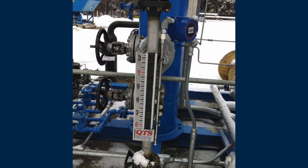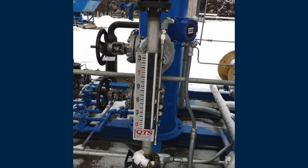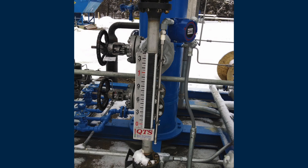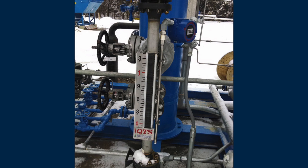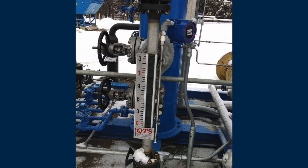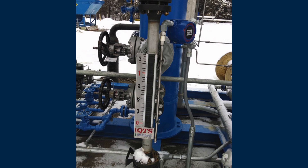They connected the ground wire at the power supply, and then touched the ground wire of the instrument to the housing — and you watched the instrument work. They removed it from the housing and you watched the instrument go haywire. This happened within a second. In this case, the issue was the wiring. I went back with my loop calibrator all the way to where the power supply was, put my loop calibrator on their wiring, and this instrument was still noisy. It wasn't their power supply — the loop calibrator is pure DC, battery powered, no noise — so this thing was picking up noise from the plant.